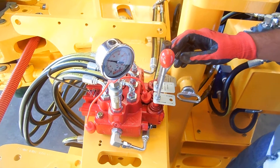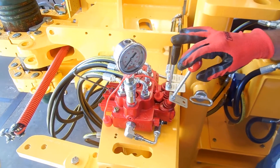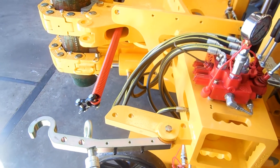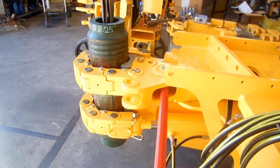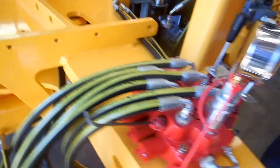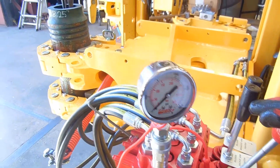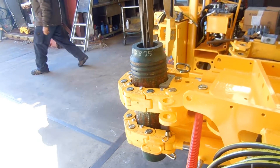We will now perform a breakout. The operator re-achieves grip with the chain cylinders and pulls the red lever into the position indicated by the tag for breakout. Breakout is when the actuation cylinder extends — that is for right-handed threads; it would be the reverse for left-handed threads. The lever is being pushed into the breakout position and you can see the pipe or joint rotating ever so slightly.